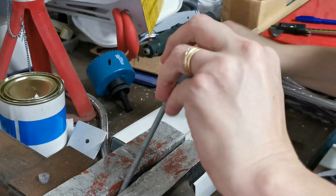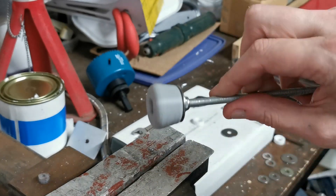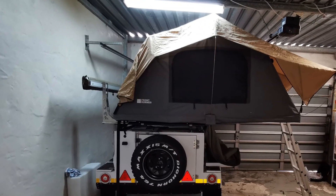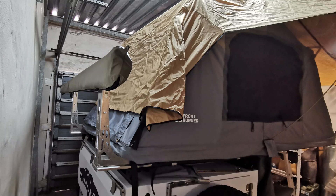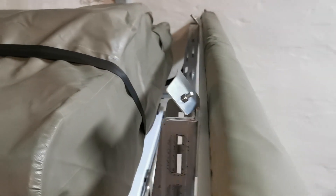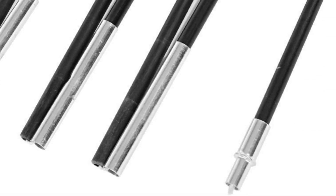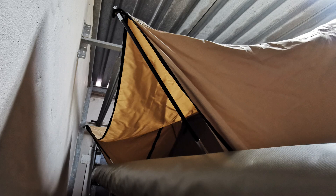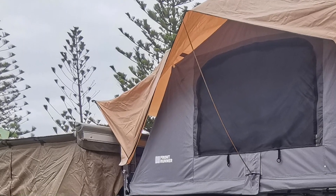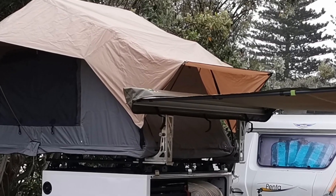So far we haven't had it come apart or lose parts, but that would need to be tested extensively on more road or gravel travel. The next problem we came across was that when our front runner rooftop tent was fully deployed, we could not use the steel stays to keep the awning open over that window because it would foul with the awning. What we did instead was create an extension bracket at the top of the awning. We got a generic set of fibreglass poles, cut them shorter, and glued on ferrules at the ends. We made short stubby little stays that got fixed with a riv-nut to the top of the awning, and in testing on our last trip this worked really well — we can now freely open our side awning of the rooftop tent without any fouling.